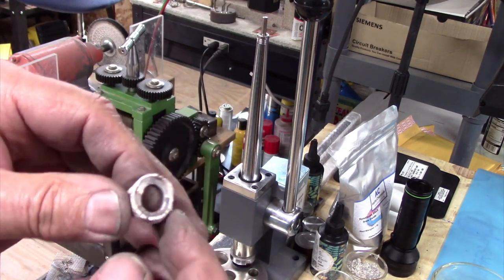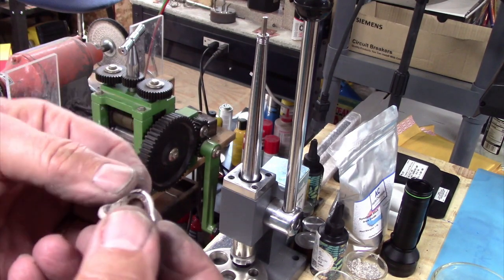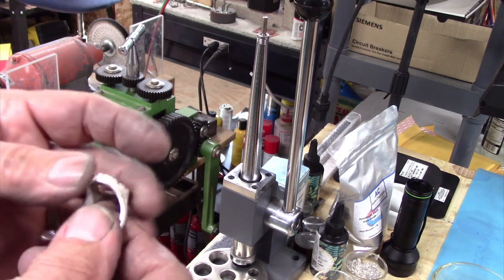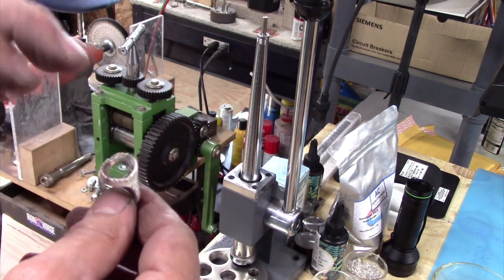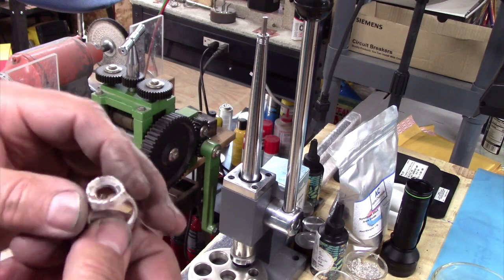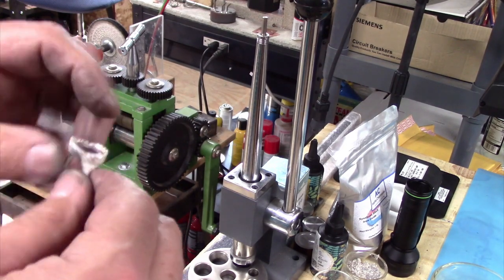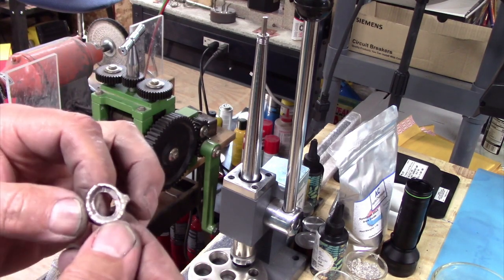and to flatten it a little bit, I ran it through the rolling mill to make it about 1 millimeter thick and a couple of millimeters wide. There's a bunch of different ways to fabricate seats like this. You could do a solid piece and then cut it out. I like an open back, so I'd like to cut it up. You don't have to. So what I'm going to do is this needs to be evened up a little bit more. It's just friction fit in there right now.